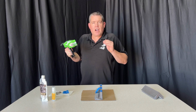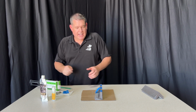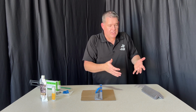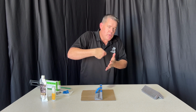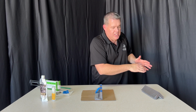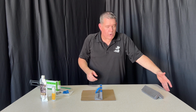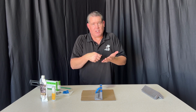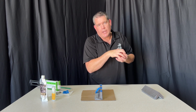minutes. You are not at risk of, by the time you get over here on that cardboard, if that adhesive has been hardening for 10 minutes, yes, you can re-mix it over here so it stays pliable, but all those molecular bonds have already started taking place, and now you're ripping them apart and spreading it down on this one to get that final edge on. This edge is going to be maybe half as strong or a quarter as strong as your first edge, because that adhesive has been drying and curing on that piece of cardboard the whole time. And every time you mix it, once it's starting to kick off, you are pulling apart all of those bonds, and they are never going to rejoin quite as tight.